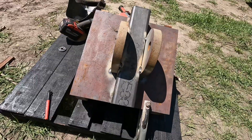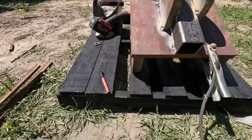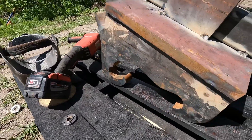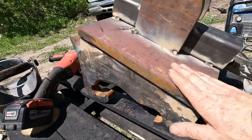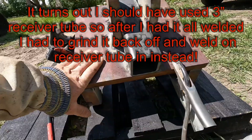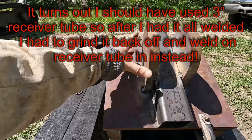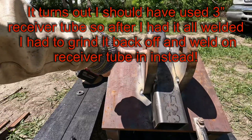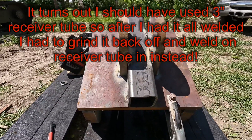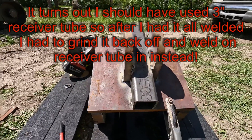Now that it's thoroughly heavy, I guess I'll call it good. For the thicknesses: I've got inch and a half on my quick connect hitch, then one inch thick plate going across — that's a 15 by 15 square. I've got a 3 by 3 tube, quarter inch thick, 15 inches long. Then these are 6 inches by 7 inches with an inch and three sixteenths hole, also one inch thick. I'll have to stick it on a scale sometime to find out how much it weighs — I can move it by hand, but it's a lug. Should serve a good purpose though.